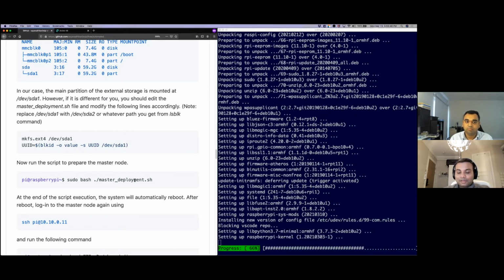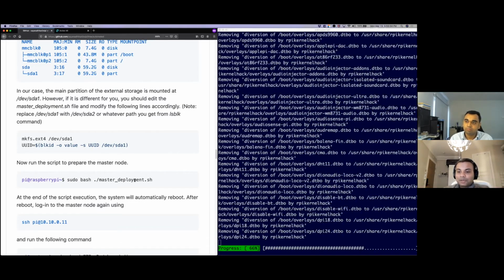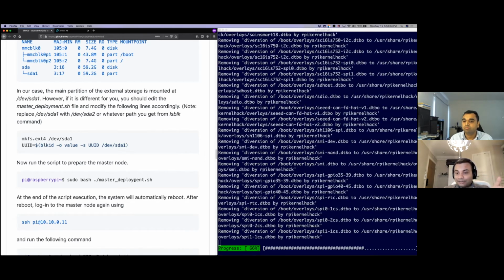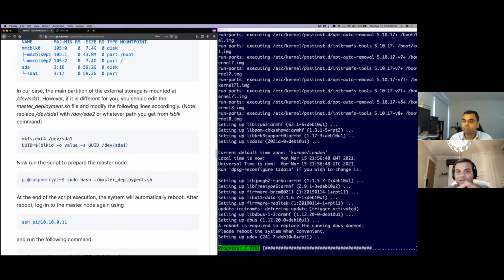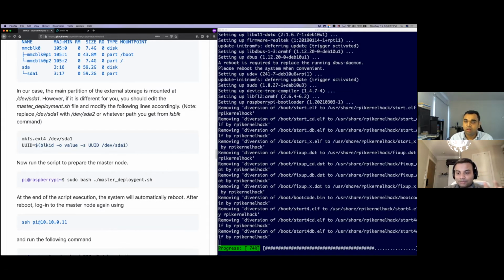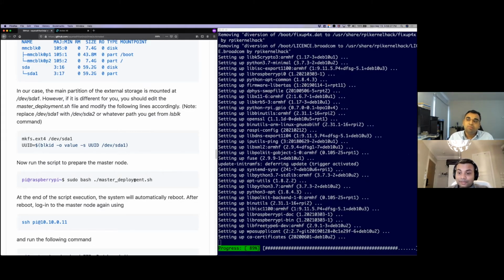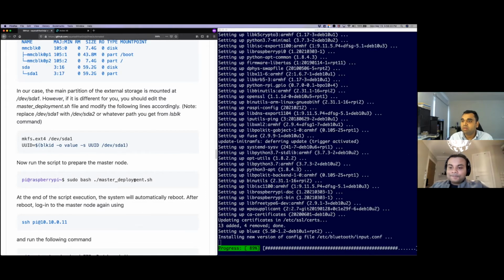Another important part is the processor that both of the boards use. Raspberry Pi uses an ARM-based processor, which is right now very popular. If you are familiar with the latest trend of MacBooks, they used to use Intel, the x86 64-bit architecture, but now they moved on to ARM-based processors. Raspberry Pi is already using an ARM-based processor. I guess one important motive for using ARM-based things is the power consumption. It's very efficient. A Raspberry Pi takes one-tenth of the power of a laptop. Is it correct? Yeah, that's very true.